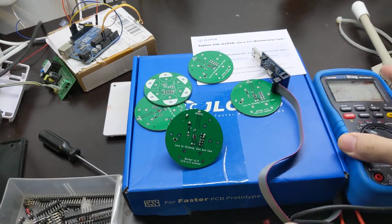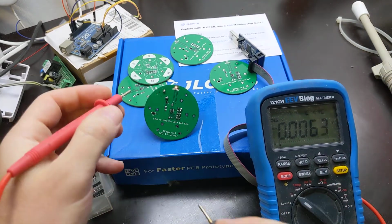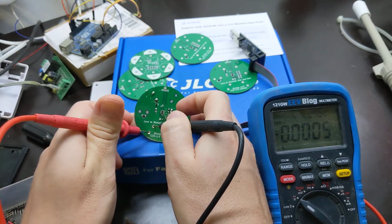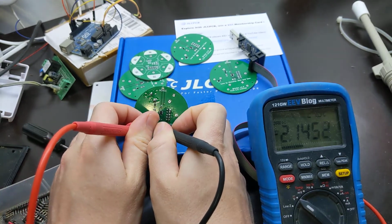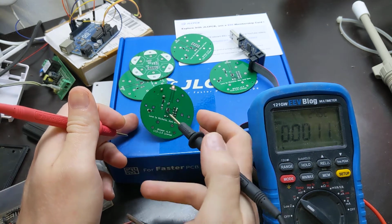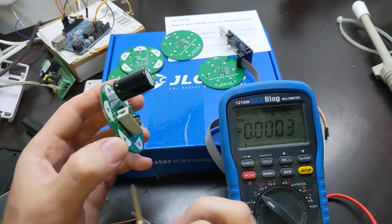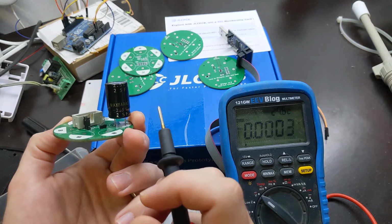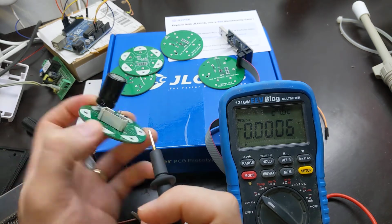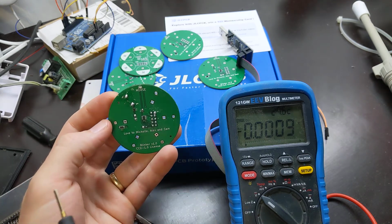So it's been running for 4 minutes, no, 3 minutes on capacitor. And what's our voltage at? Oh. So we're down to 2.1, and we started at about 2.3, which is pretty good. That's only running with one undersized cap. I couldn't get any 40 farad caps, or I think I got 35 or 40 on the actual design. So I've got one 25 farad cap, and it's holding it up. It's probably gonna keep blinking for a while, even with the inefficient code on there.